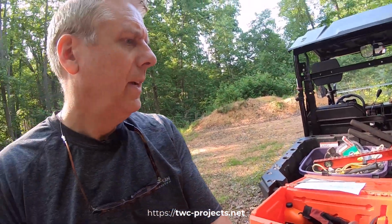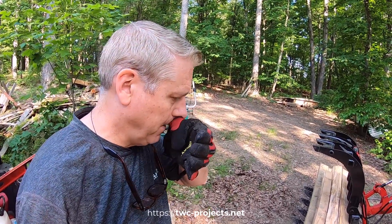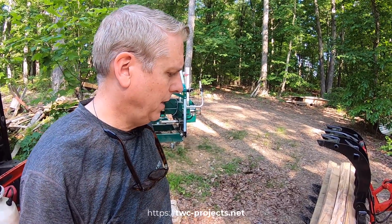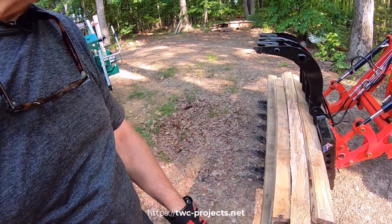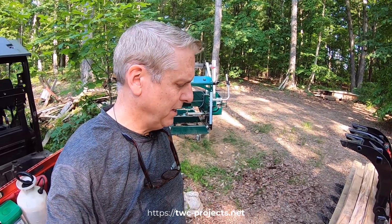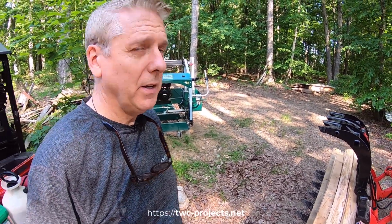I'm kind of worried that I've taken on too much this coming week that I'm taking for vacation, and I want to get something up. So I'll probably do another video of building out the gates. I'll build them here and then take them up. I usually like to put tar around the bottom, the part that goes in the ground, just like the basement sealer tar. You've seen me do that when I built the pole barn and probably some other things. So I'll do that, and that'll probably be another video building out that gate.